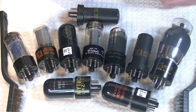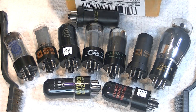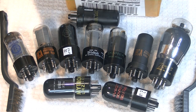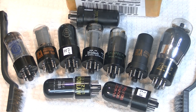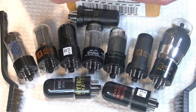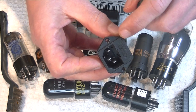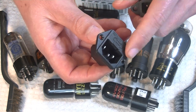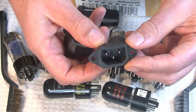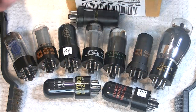Let's take a quick look at what came in this week — a lot of stuff has been coming in lately. Many of you know my hobby — not my business, my hobby — is designing and building tube amps. I've been working on a prototype phono preamp and a couple more line stage preamps, and I've been running out of space. This is my typical IEC inlet — it has an integrated fuse holder. Many of you probably use these. They're very easy to install, solid, and it's nice to have the fuse in. The old style has no fuse and no switch, and they work fine if you want a separate fuse holder and separate switch. They cost next to nothing.